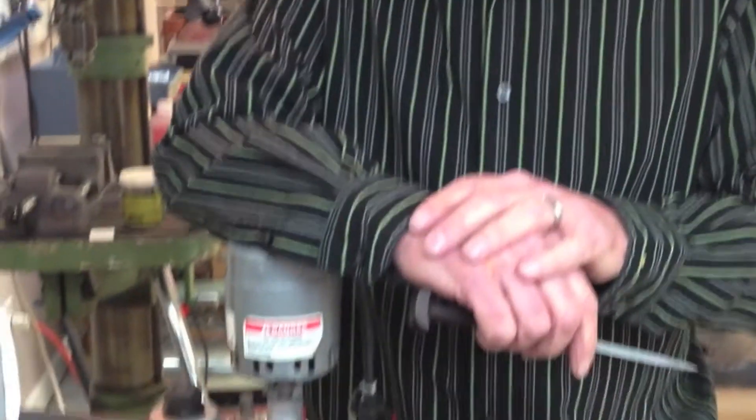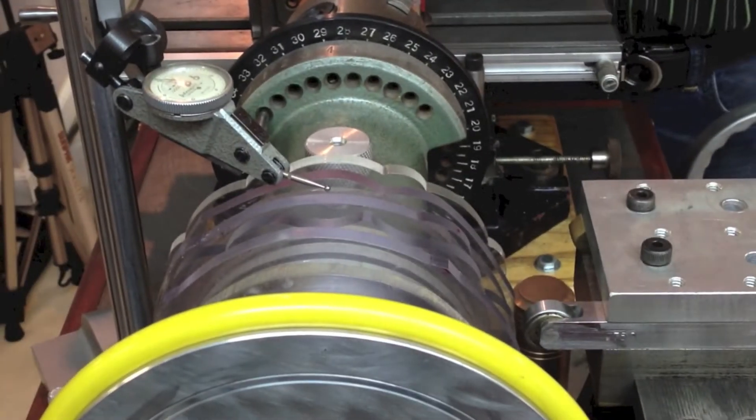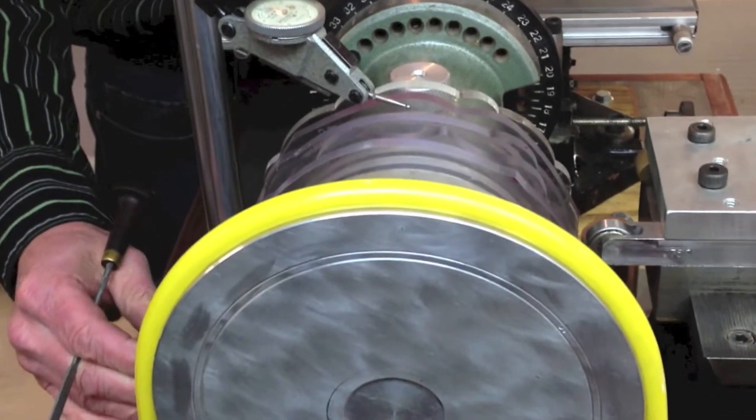If you want better than that, mark the two highest points and then take a small jeweler's file and draw it down two and a half thousandths — whatever you need — and you can bring them within tolerance in about five or ten minutes. This is a good machine; it runs concentric to within about two and a half thousandths, which is acceptable. It's a nice little beefy machine with a spring in the back.